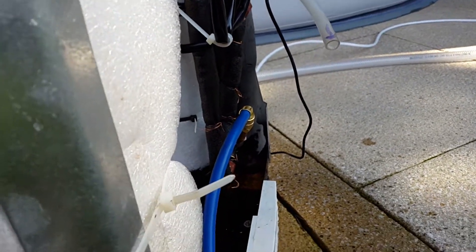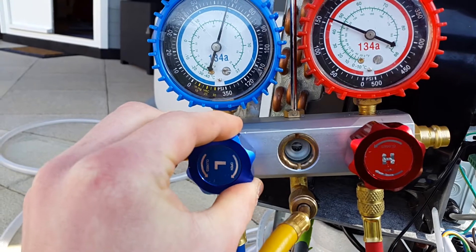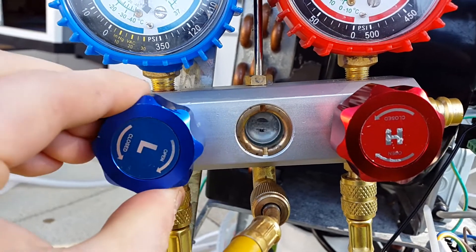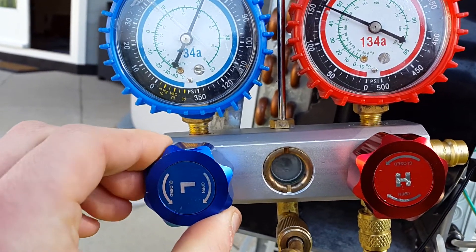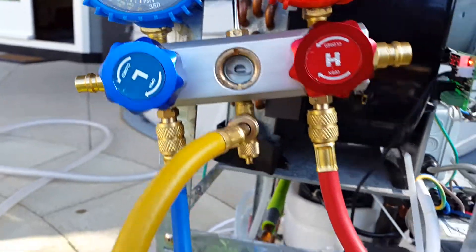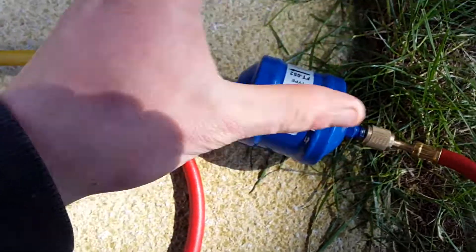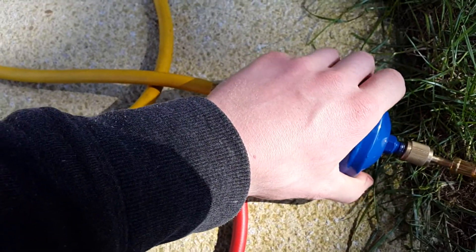The unit does have a built-in suction accumulator. When it starts making a bubbling noise, that's when the accumulator fills up. I think for a system like this I really need a bigger filter dryer — something about a certain size would do. I'd really like one with solder fittings rather than flares, as I want to avoid flare fittings as much as possible because they can leak.